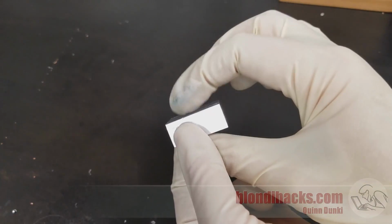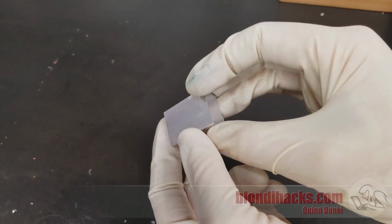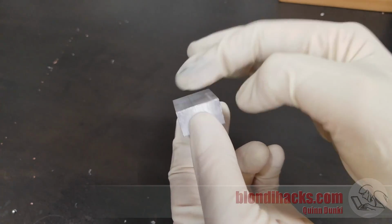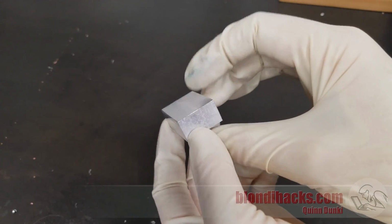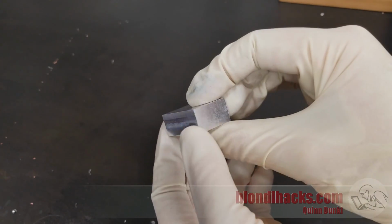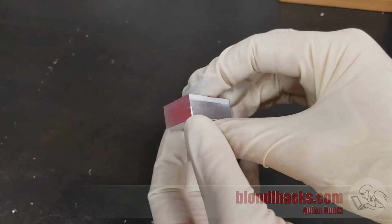And again, that dimensioning process you can combine with squaring up if you're paying attention and planning ahead a little bit. At each step where you've got a machined surface down on the parallels and you're facing this one, you can not only face it, but bring it down to final dimension at the same time. You got to be a little careful doing that. It's easy to forget where you are and mess up the whole part, but that will save you a lot of time when squaring up stock. So now we're ready for layout or whatever else we might need to do to start making our part.